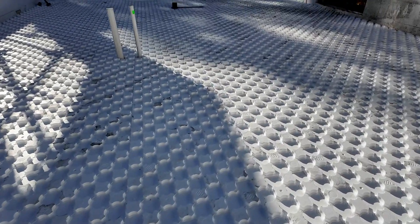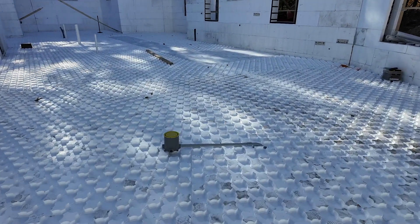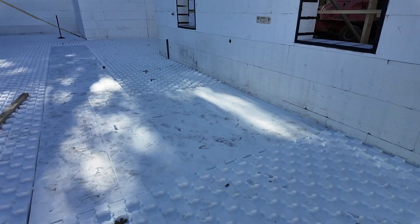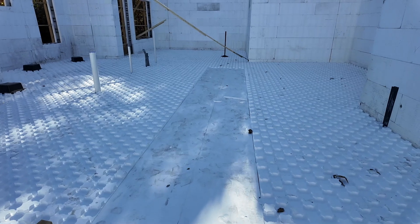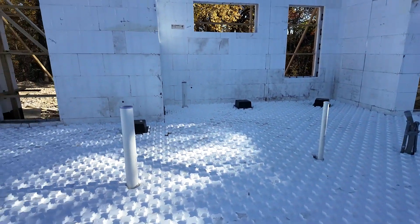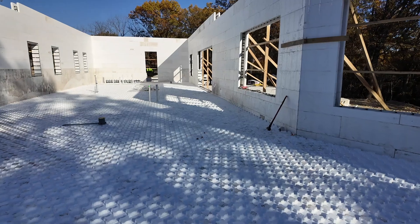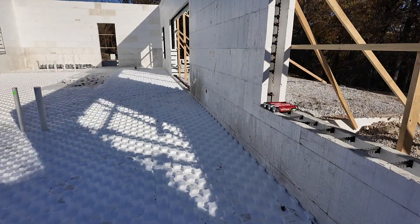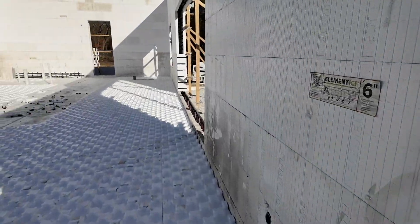We also have to insulate those portions because they're so close together that they were going to overheat parts of the floor there and make it different than the rest of the structure. We also have a secondary manifold system feeding the bedrooms — kind of right here in the laundry area, it's flat too, so all those will go down this hall. They'll be insulated and they just feed into the office or library and then the master suite. The only part they haven't laid is the patio area with the ice melt system, but they've redesigned that so the manifold is under the stairs and it will feed the ice melt outside. So I don't have any runs underneath the heat sheet, which is handy.